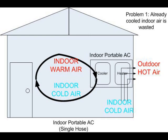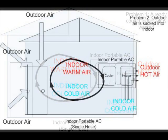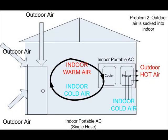And this is actually not enough — there is problem number two. As the indoor cold air is pushed to the outdoor, some air would leak back into the house; this happens otherwise the house would run out of air and become a vacuum, which is not possible. With all the air leaking from the outdoor to the indoor while the AC is running, it is like running an AC unit with the windows opened. I am sure everyone has experienced what happens if you don't close the window with the AC on — it takes forever to cool a room.